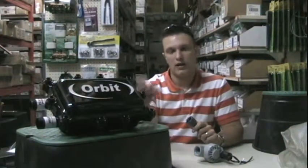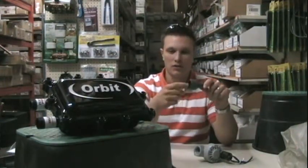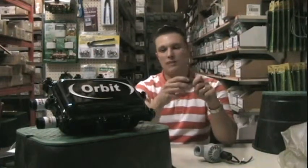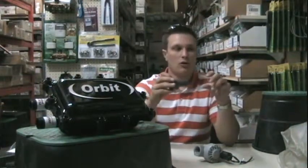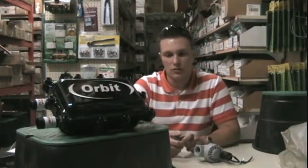For the inlet and the outlet port, you'll need a female insert adapter — female threaded by male insert. If it's one-inch pipe you're dealing with, you'll use a straight one-inch adapter, or you can use a reducing adapter to get it down to three-quarter inch if that's what you're using for pipe.